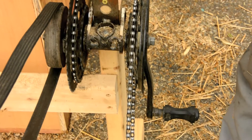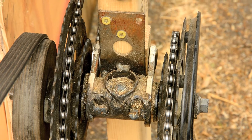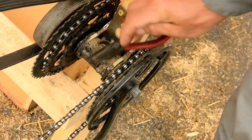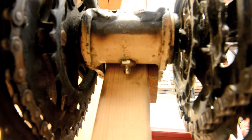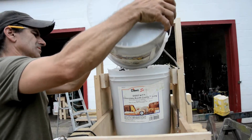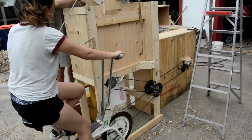You can also take the hub shell, shorten it, and weld-tack it back together with a welder. This bottom bracket is just a cheap steel bottom bracket off of a cheap mountain bike — very high quality bearing, incredibly high quality spindle. I've welded some metal tabs onto it so I could screw it to the frame, and I welded all the holes shut so that debris can't get into the bottom bracket and pollute the bearing. I also installed a zerk fitting so the farmer can just casually pump grease into the bottom bracket once every couple of years and never have to service it.